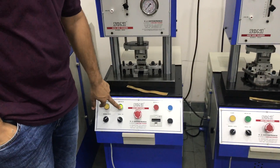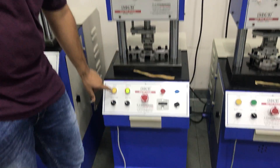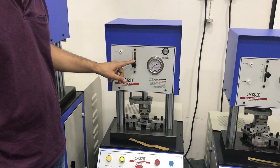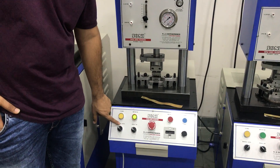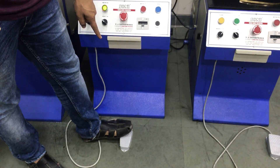This is on, off. We have manual and auto mode. When we put in manual mode, we can work manually. From here, we can set the stroke — how much we want the die to open and close. Once the stroke is set, you put the switch from manual to auto mode. And you can operate it with the help of a foot switch.